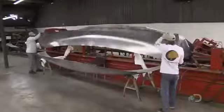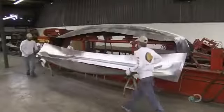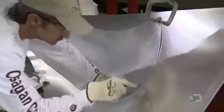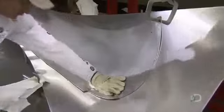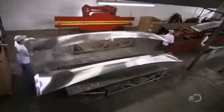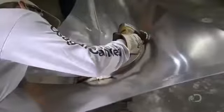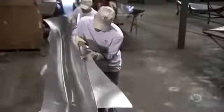The molded sheet needs trimming, so they transfer it to a work table and place a template over the contoured section. They clamp it into place. With a scribe, one of the workers etches the pattern onto the molded aluminum. The team then transfers the aluminum sheet to a jig and cuts out the pattern following the etched outline. They shape and cut a second part exactly like the first. The two symmetrical halves will form the hull of the aluminum canoe.